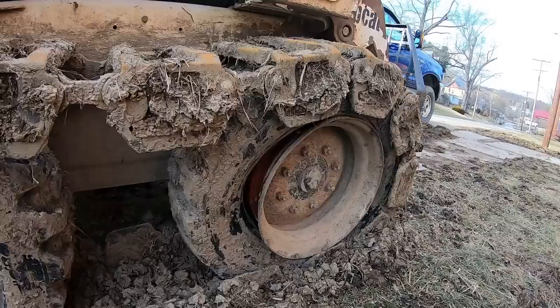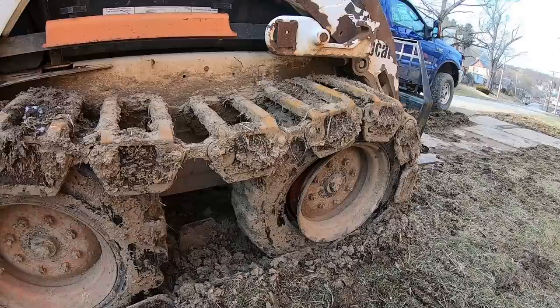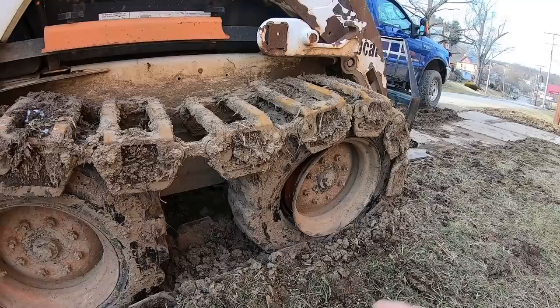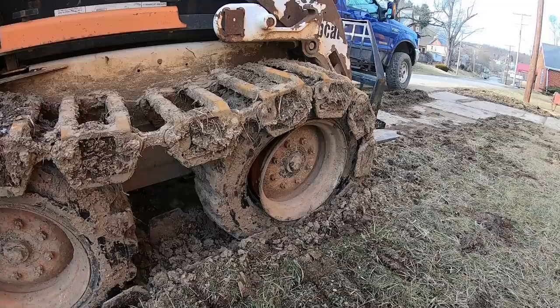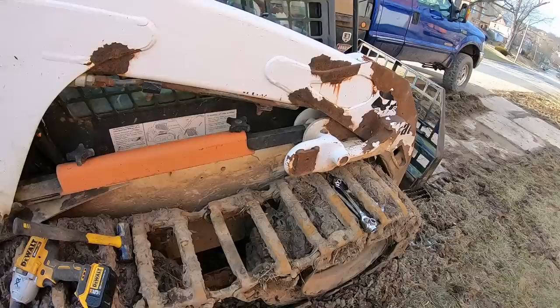So here's what I got into today. Down at the church with a problem on the skiddy — these grouser brand tracks are really awesome, they do excellent in really wet conditions. One problem is if you start to get a low tire and don't notice it, when you turn the tracks will pop the tire right off the bead. That's not common but it's happened to me more than once. This time it happened in the middle of a job and it ripped off the valve stem, so I've got new valve stems. To get the tire back on the bead we're going to have to take the track off, and maybe take the tire off — we'll see.